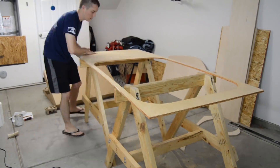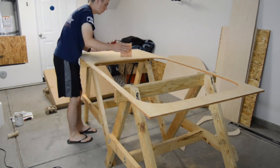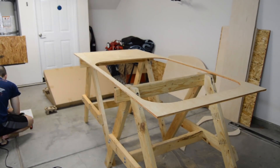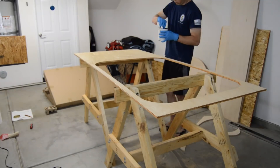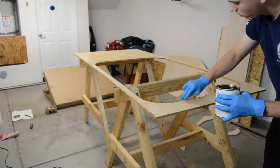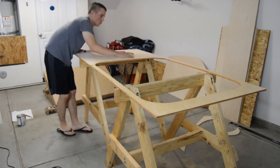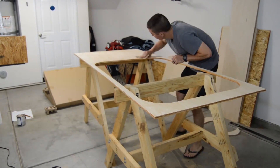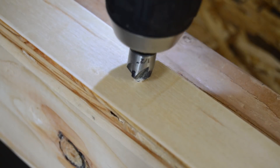I applied three coats of varnish and lightly sanded the tabletop with 400-grit sandpaper before each coat. Turns out that getting varnish on your hands makes for a fairly sticky situation. After one final sanding with 400-grit sandpaper, my tabletop was done. The varnished birch gives the tabletop a very nice golden color and the finish should last a very long time. I installed the tabletop by drilling a pilot hole and using a countersink bit to avoid cracking the plywood, spacing screws six inches apart around the perimeter.